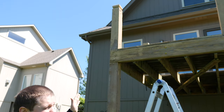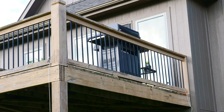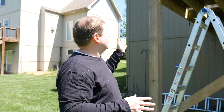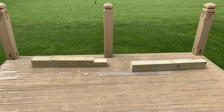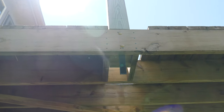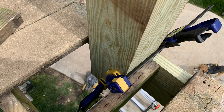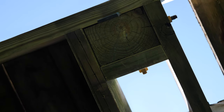Adding additional posts on the side. Instead of having 12-foot sections of railing on the side that wasn't very stable and wasn't supported very well, we're going to have more 6x6s on the top. We had to add additional blocking underneath this post in order to get it attached properly. We ended up notching the bottom of the post out so it could sit on that joist, and we attached it with three different carriage bolts, nuts, and washers.